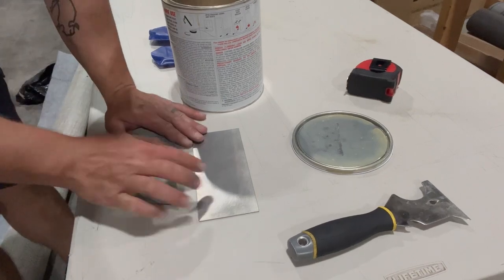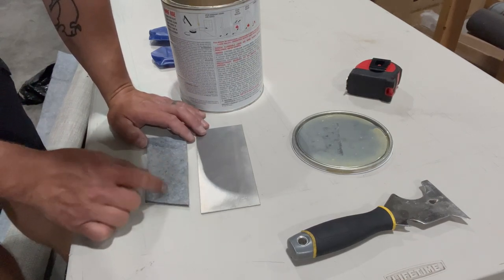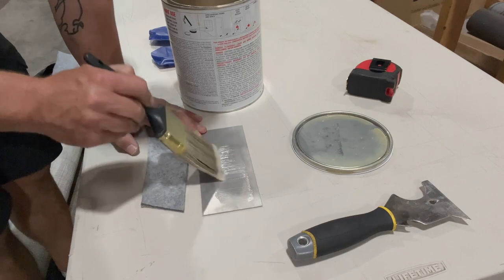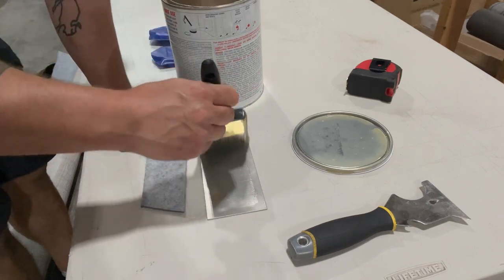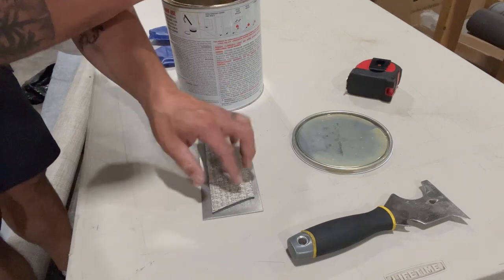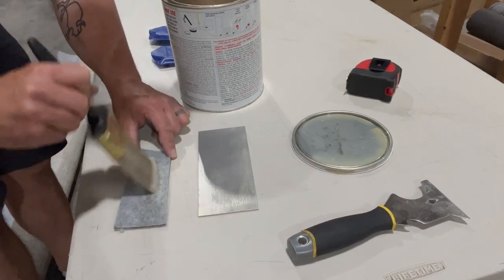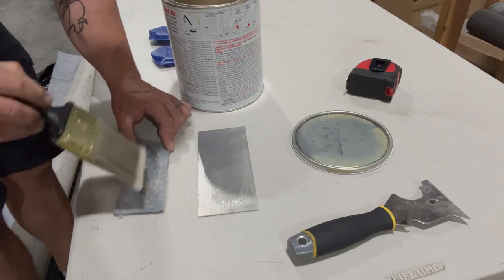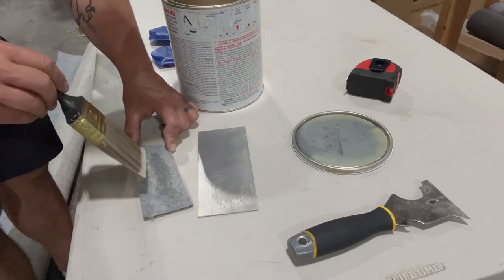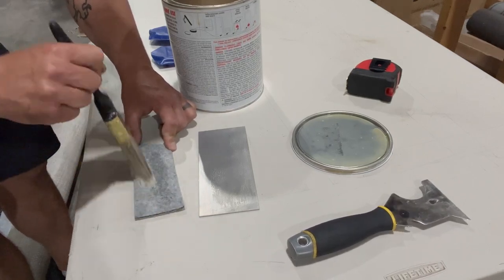So what I have here is just a scrap piece of aluminum I cleaned off and a piece of the same vinyl we're using. I just want to show you the timing and what this looks like when it's ready to stick together. I'm going to use a paintbrush just like we applied it on the upper deck and brush this on, and then I'm also going to brush it on the vinyl - because if I just stick these together nothing happens, it actually comes right off. When I get that adhesive on the vinyl too, the key is just trying to get it as even as possible. If you get it on really thick, it's going to absorb into that felt.